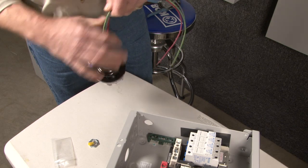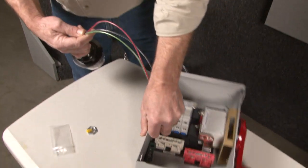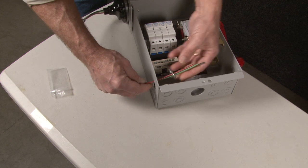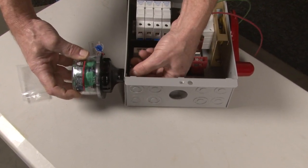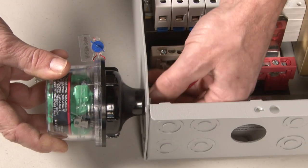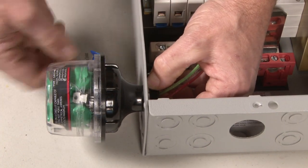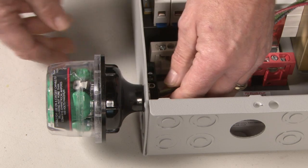The O-ring goes on the outside of the chassis. When we tighten up this little ring, we don't want to get it too tight because it will start bulging out — all it needs is a nice tight fit. There's also a little lock tab here: if you take it off, the warranty is expired because it means somebody has tampered with it. I like to put it to the back side so if somebody's walking by they won't catch it on their clothes.